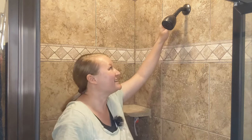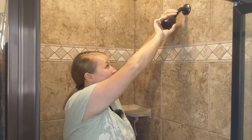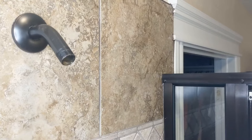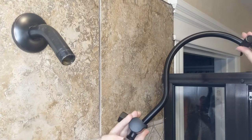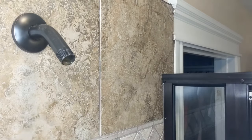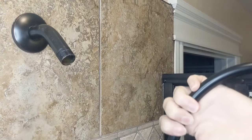Now we're moving into the shower. I'm going to twist off the old shower head — just hand twisted, a little muscle power. Now, the first piece you want is the head holder piece that goes into your pipe. But first we need pipe tape. So I'm going to grab some pipe tape to put on there, and then we'll attach this. Pipe tape is white, super thin, not sticky — like a very thin piece of fabric. We're twisting the head on clockwise, so we want the pipe tape to go clockwise too. If you go counterclockwise it'll get all bunched up and won't work.